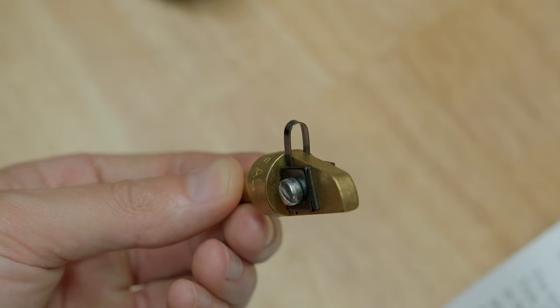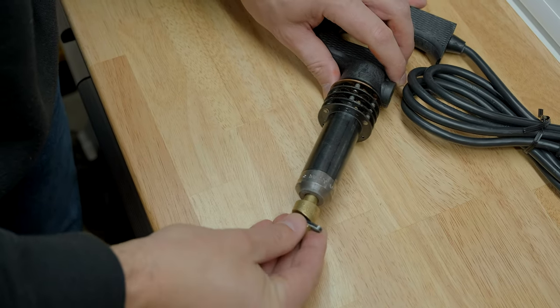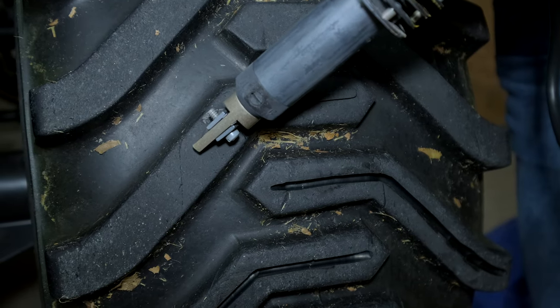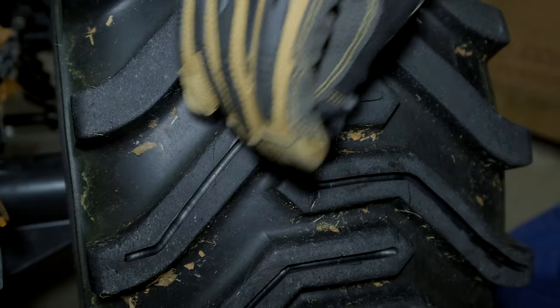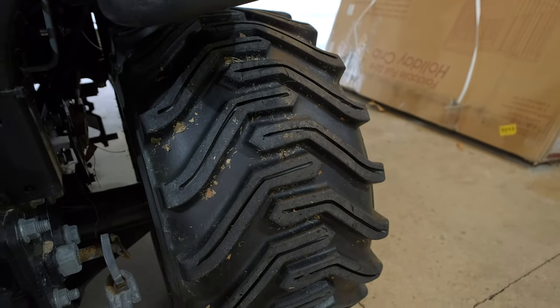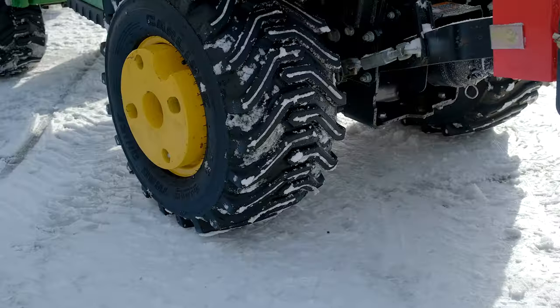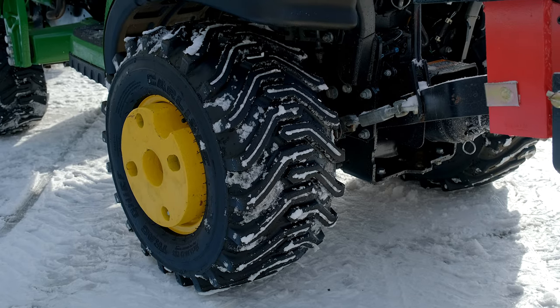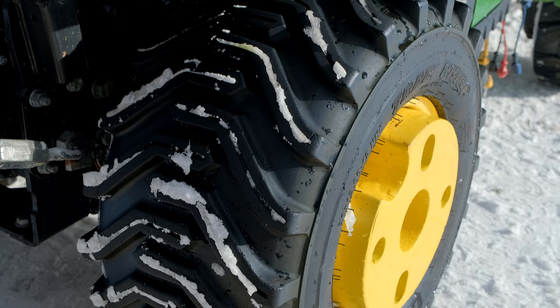Five tips to increase traction while you're plowing snow. We tried grooving tires last year and I think that made a big difference. We had R4 tires — I've used those historically to plow snow and they do a terrible job for me. I've been stuck just off the side of my driveway, struggled to get up my old driveway which wasn't even super steep — all with those un-grooved tires. So we grooved our R4 tires last year. You heat up a grooving iron that has little steel blades, channel it along the tire, and it made a world of difference. A fairly low investment — under a hundred bucks to get that gun and get your tires done. A pretty cool option to consider.